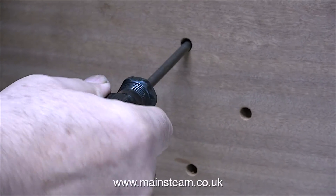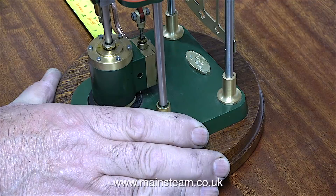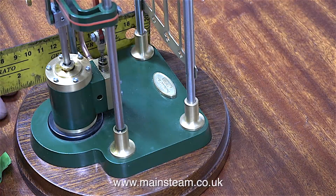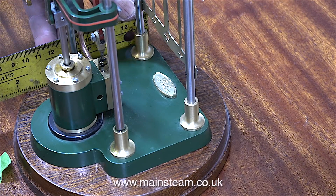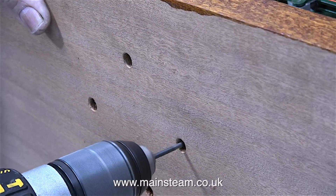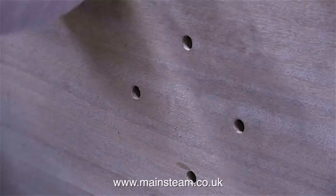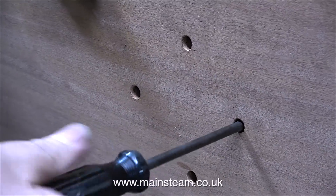As I've only piloted one hole in the engine's baseboard, I put a screw in that to hold the engine to the baseboard so I can make sure the engine is in exactly the right position. I'm using a set square to verify that the base of the engine is perfectly aligned with the main baseboard edge, checking both sides just in case the casting is not 100% true — though as this is a CNC machined engine I would assume it to be correct. With the engine in position all I need to do is drill 1/8th inch pilot holes through the remaining holes in the main baseboard, then screw in three more screws using a screwdriver by hand. Sometimes it's just better to do things by hand.